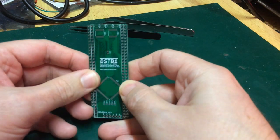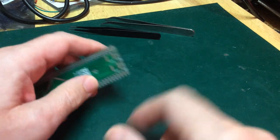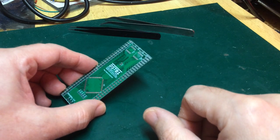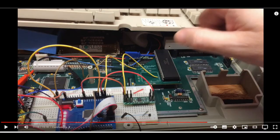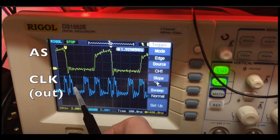You might remember a couple of videos ago, we did a little hack project on the STE. We had an adapter board for the PLCC CPU to the DIP64. I put a 16 megahertz CPU in there, and I applied a little clock hack using a couple of fly wires and a breadboard and a CPLD development board to get it to run at 16 megahertz, switching the clock up and down when it accessed the motherboard,